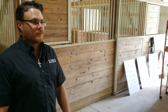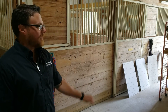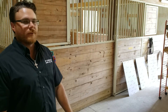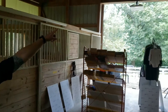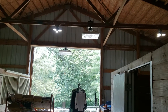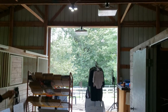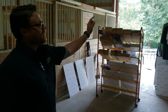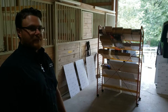We're here today with the RF Controls EAS system — Electronic Article Surveillance. We're going to demo a highly populated doorway: we'll take items through, hear alarm sounds, and identify the tag. There is one antenna inside the store, horizontally mounted, performing most inventory tasks to keep tags from triggering false alarms. A secondary antenna above the door is our primary alarm antenna — it scans fast and picks up items as we walk through.